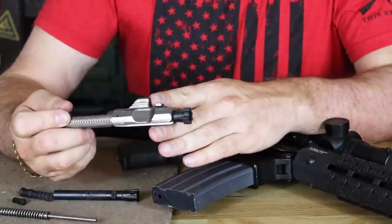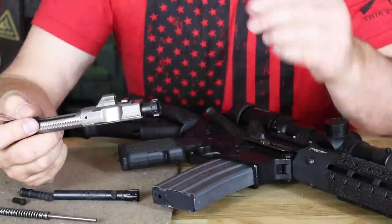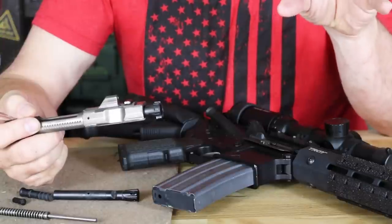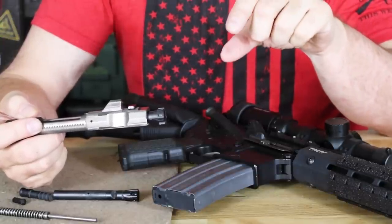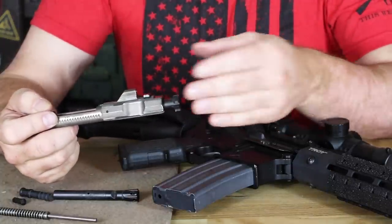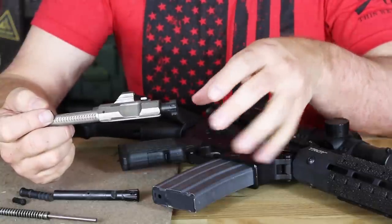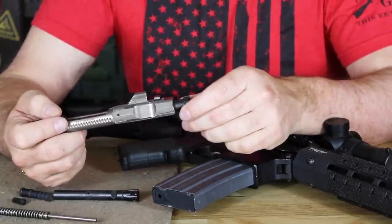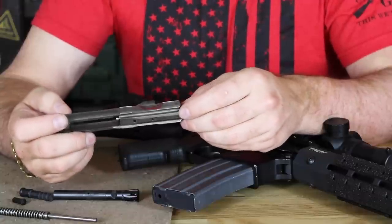Standard mil-spec bolt, Carpenter 158. Now, the 7.62x39, if you go back to that video, you're going to see that there are some specific differences between that bolt and anybody else's bolt and the firing pin. He has a specific 7.62x39 firing pin, and his bolt, its extractor, has some modifications over what anybody else does, and some differences in the geometry of his locking lugs. So he's done some things that are different. These are not standard bolts. These are his bolts that are made to his prints, just like the carrier. This is all made to his prints.